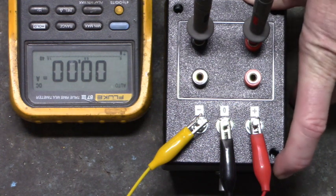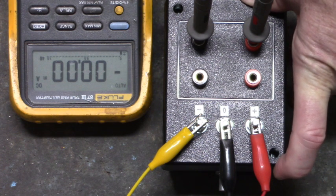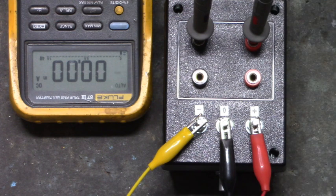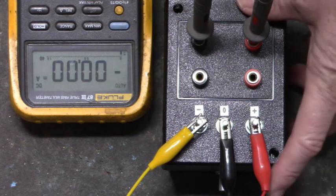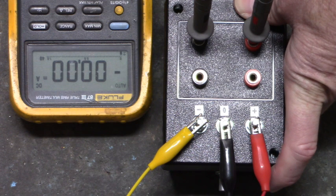When I get back to the house I'll put up the diagram — I'll put up my drawing of that circuit. It is very, very simple. The mechanical part of making it was harder than the actual running of the circuit — there's not many parts in there. Always, if you can go with the easy, it makes your life a little bit easier. No need to make things more complicated than they need to be. This box right here will do it — it will give you a 4 to 20 milliamp speed reference if you ever need it.